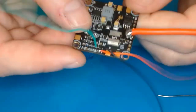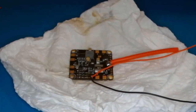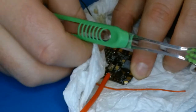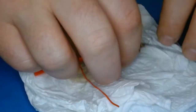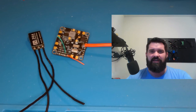You can see we've got another really clean joint. Now we'll clean the board — place it on a paper towel, dip a toothbrush in some 99% isopropyl alcohol, and give it a little scrubbing. This cleans all of the flux you used, keeps your board from being sticky, and prevents it from gunking up while you're out flying. As you can see, it's a nice clean board. Alright everybody, that's all I've got — thanks for watching, and if you liked the video or found it useful, please like and subscribe.